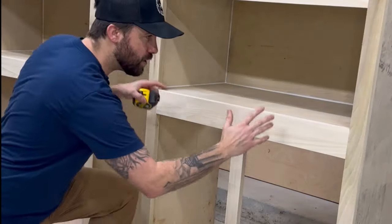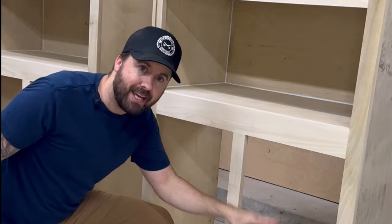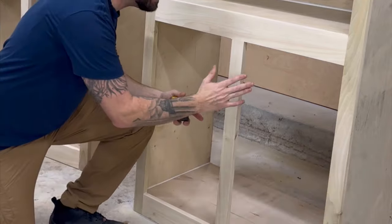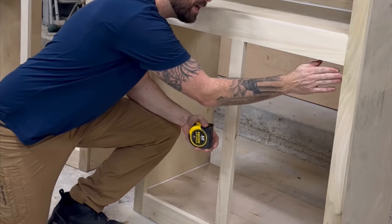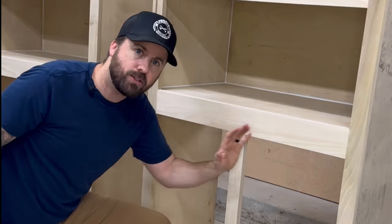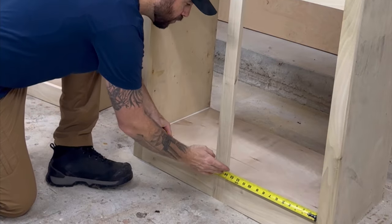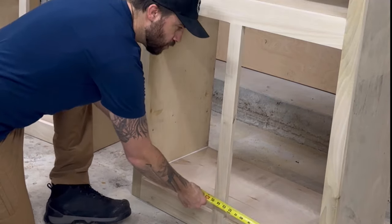So yesterday we finished up both cabinets that go on each side of the Murphy bed. Today we're going to be working on the cabinet doors. We want these doors to be inset, which means they sit inside flush with the face frame. That way our sliding bookshelves don't hit the doors when they're opening and closing. So we're gonna make these doors 1/4 inch smaller than the opening. So we wanna be